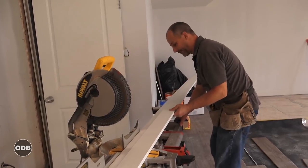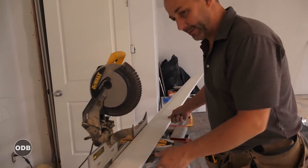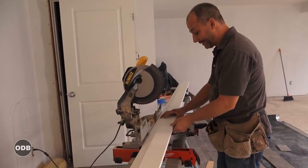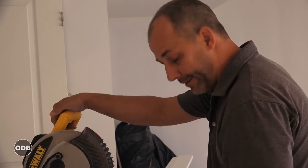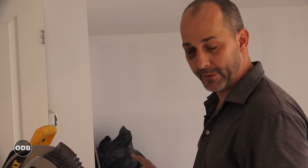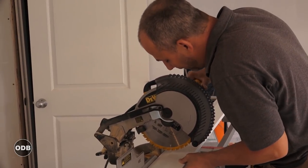We're going to adjust our saw. Our actual measurement was 118 and a quarter — I'm going to be cutting the board down to 3/16 smaller than that to account for the mud that's built up in the corner. That will also give me the opportunity to make any adjustments necessary on the floor when installing the corners. You'll see when I put this all together that cutting it small has an advantage.